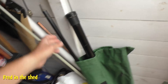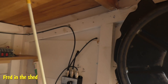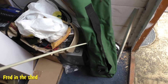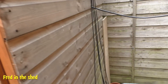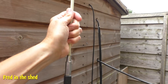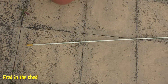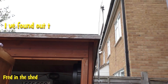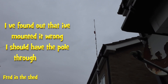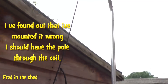To mount this you need a non-conductive pole. I hadn't got anything to hand, so I decided to use the top section of my Antron 99 — even though it's got a conductive element inside, the outside is just fibreglass, so I thought I'd be able to stick it up above the shed. Typical shed approach — I was just using up a few poles and brackets left over from other projects. This gooseneck pole was absolutely ideal; it's my original pole from when I first got back on CB. Decided to put it up on the shed — it might just be a temporary setup for now.